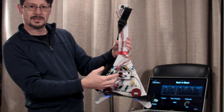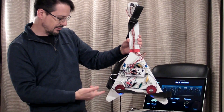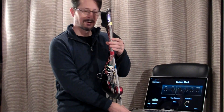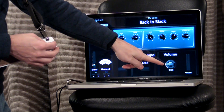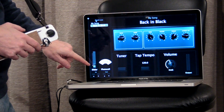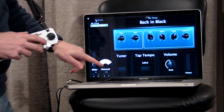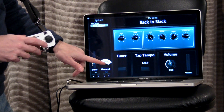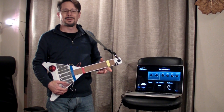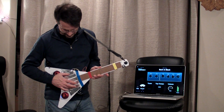All of the inputs from the sensors and from the pickup contacts are passed through a USB output cable into a laptop, which is running Apple's MainStage software. My slider here controls a virtual slider, which I've connected to a sort of vibrato control. And then the photo cell, which is connected to this VU meter here, is wired up to act like a pitch bender. So it took me only about an hour to cobble together this little instrument, but it works remarkably well for what it is.